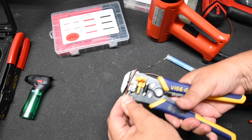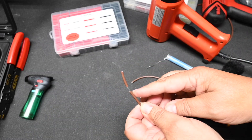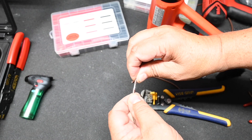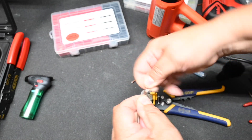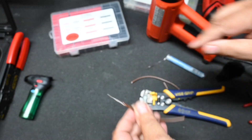Here's a tip: when you are trimming these wires, what I like to do is just cut it like that without taking the insulation off, and then when you pull the insulation off you twist it as you pull it off, and what that does is it pre-twists the wire for you.